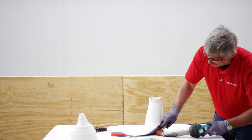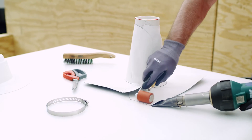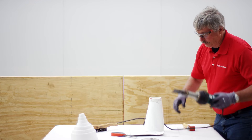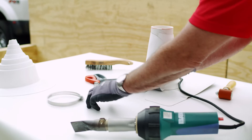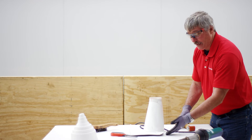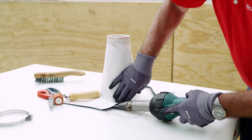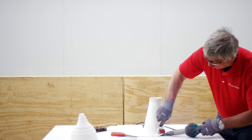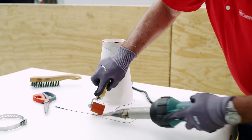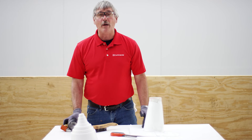I'm doing a two-pass weld, looking for bleed out. Once I get that welded, I'm going to come back and do this little junction right here. Now this is a T-joint — you've got to pay special attention. Do I need a T-joint patch on this? No, this is 50 mil, but again, if there's a void there the inspector is probably going to make you put a patch on it. So you want to pay special attention to this area. Then it's just a matter of going on and welding the flat all the way around.